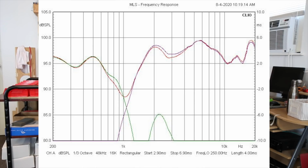So you see the woofer's response, and you see a peak at the top of the woofer's response that wasn't controlled by the crossover. You see that hump come back up. But you see where they sum, in red, it didn't gain any output, and it's not in phase. It's about 90 degrees out of phase.